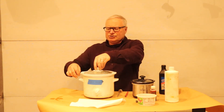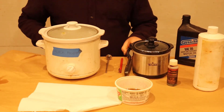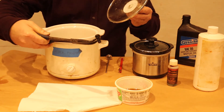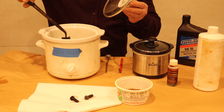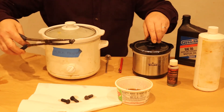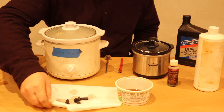It's pretty straightforward — you just take your fasteners, put them into your solution. That's the black one; take the gray one you want to plate and put it in there. Wait about 15 minutes, pull them out, and you will see the results. These have been sitting in the crock pots for about 10 minutes now. We'll pull them out — being 180 degrees they evaporate off really quickly. There's our black hardware, and here's our gray hardware — you can definitely see the pronounced difference.